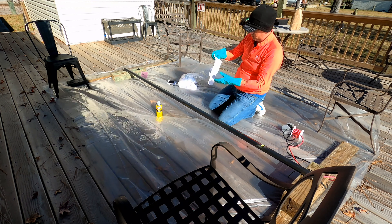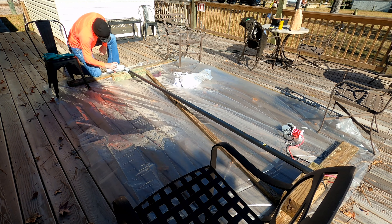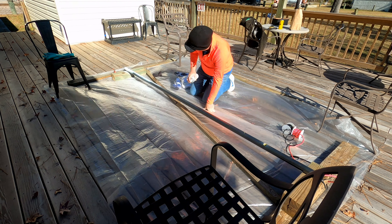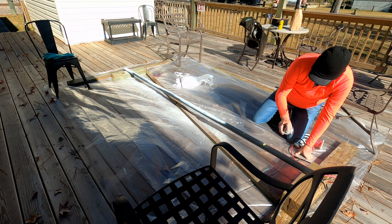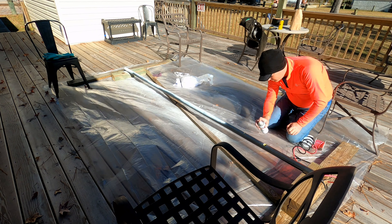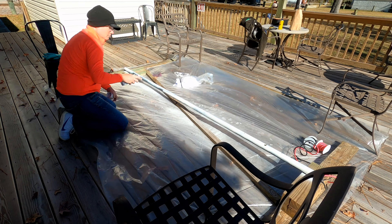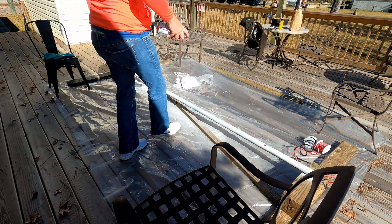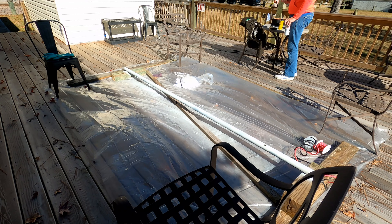When I had all of the bolt holes drilled I had to remove the metal flange. The metal flange has an inner cutout diameter of 1.9 inches and the hole saw I had was 2.0 inches, so I had to remove the metal flange and try to drill as level as I could through the wooden block and the deck. The wedge and the deck combined were too thick to go through with one pass of the hole saw, so after getting through the wedge and into the deck I removed the cedar wedge and drilled the rest of the way through the deck.